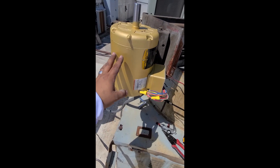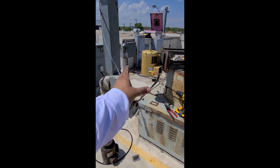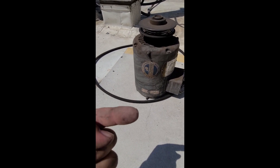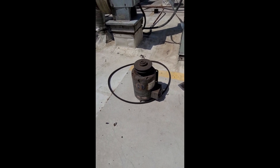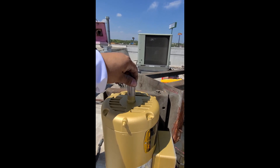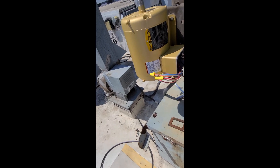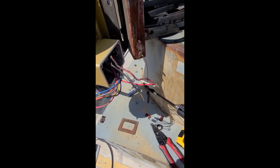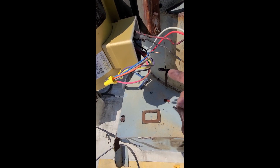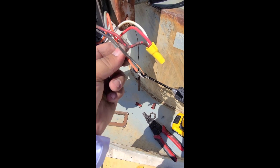The last thing to keep in mind is the rotation. I pulled the old motor off the frame and set it exactly as it sat on the frame with the two little legs. You can see there's a sticker on it showing the rotation direction. It's going this particular way, so I need to match that. I'm going to connect any of these three wires to any of the three incoming phases, and if the rotation is wrong I'll just switch two phases.